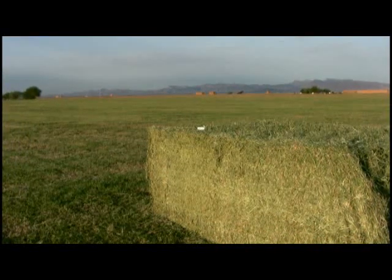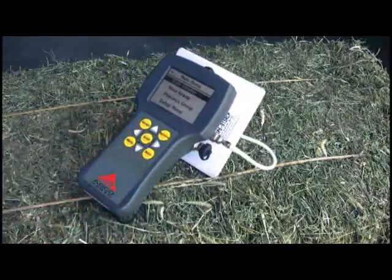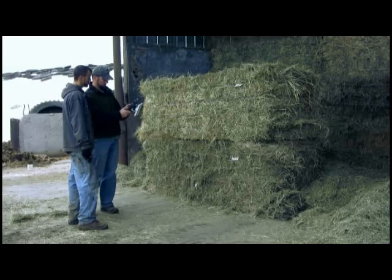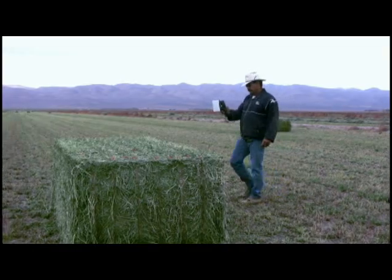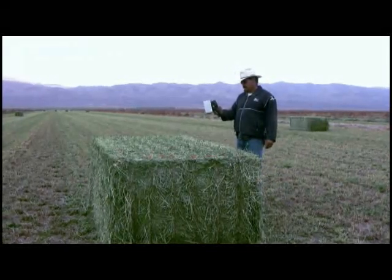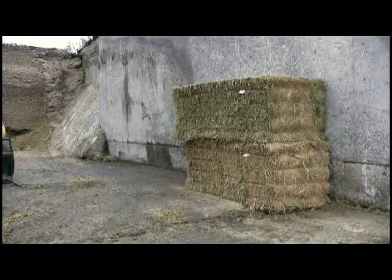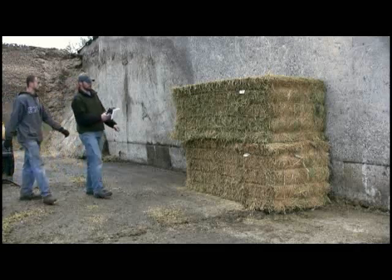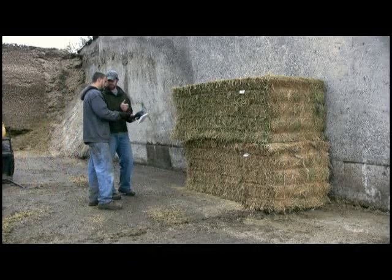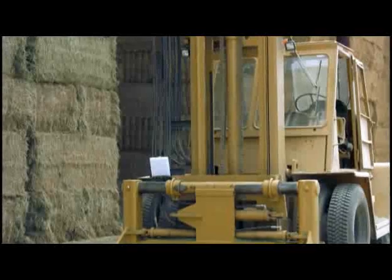You can read all of that information with a scanner. The AGCO HayBoss G2 Model 860 Scanner can read the tag at any time. In handheld mode, the tag can be read up to 10 feet away. You don't need to see the tag. The scanner works on radio waves that travel through the bale. The tag information will display on the scanner's display so you or your customer feeding the bale can spot check bales to see what they are. Most of the time, operators are scanning bales as they are later handled. This is when you would want to know the most about the bales.